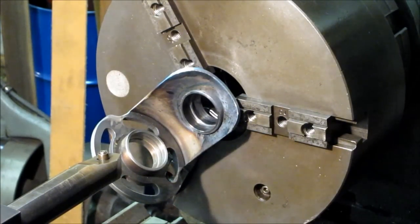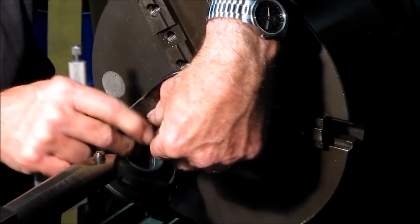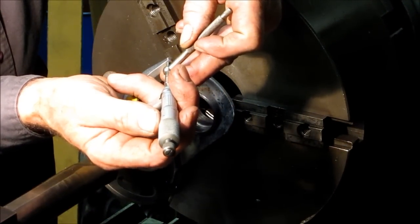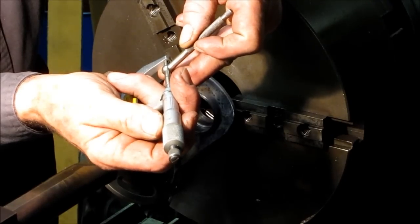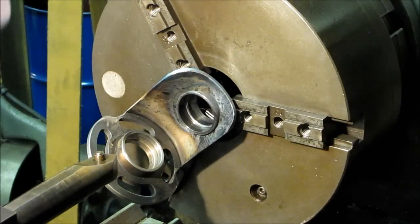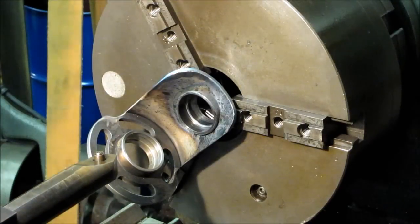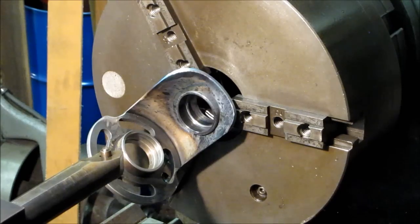Alright, I'm going to go get a bearing. We're just throwing a snap gauge in here — we want to check the diameter across there. The welding actually shrunk that almost two thousandths. I'm reading about one there and if we figure we were comfortable, we were comfortable about a half over on the micrometer. Yeah, I'm about a half over. So we're going to try to take about a half-thou cut at a time here.